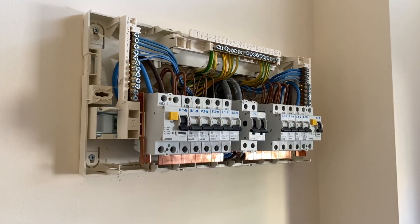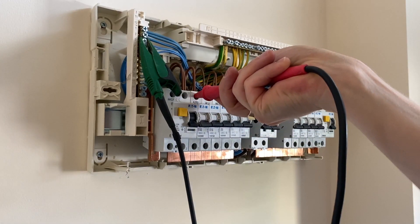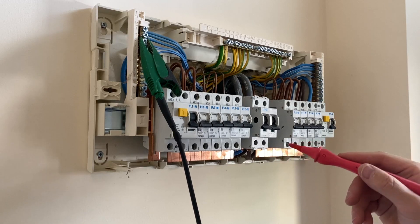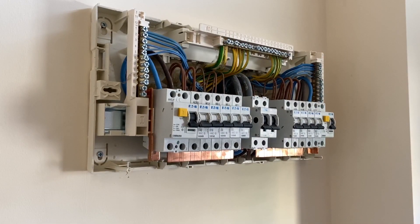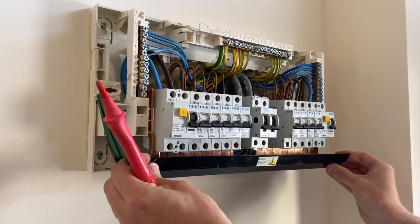Clear — okay, so sockets downstairs: I'm guessing it's just the appliances that are connected. If I turn the isolators off for the appliances, that should clear it up. I've now disconnected the appliances and that's all clear. I just turned off those switch isolators for the various appliances because it's impossible to disconnect them as they're built into the units.